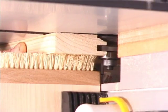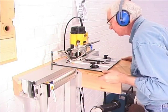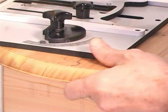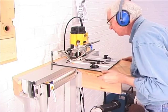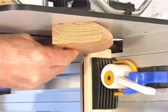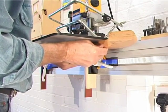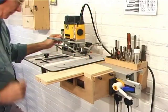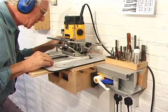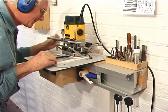Having the cam clamp directly under the cutter has other advantages. A board is set with a sharp pin and allowing you to spin a circle. This profiles a round tabletop for a spindle table. And there's more. Place a rounded board exactly under the cutter and you have a setup for pin routing. Here we're making the spindle table legs. This profile is for a cupboard door using a cope and stick joint. To hold the rails, we need the box, which can take a stack of pieces at 90 degrees to the machine.